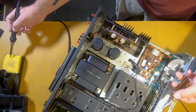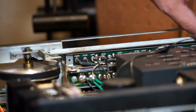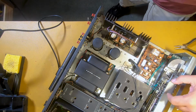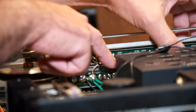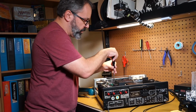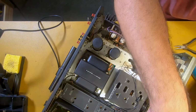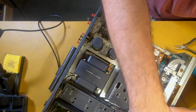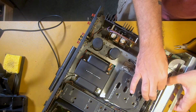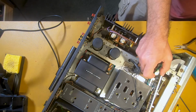Here's our other lamp. We're gonna replace them with these 8-volt LEDs. What we're gonna do is we're going to remove this board here and pop it out, and then we're gonna put the bulb right in. So the screws for those are right here and right here. If you feel like your screw's gonna strip, you get a fatter screwdriver and it'll get it real good. Yep, the board pops right out like this. Now we don't have a lot of slack because the wiring is kind of tight, but since we're just doing the first couple, this shouldn't be too hard.